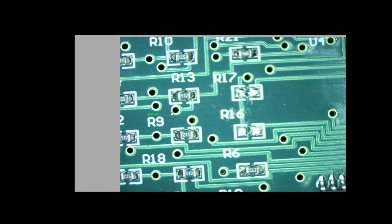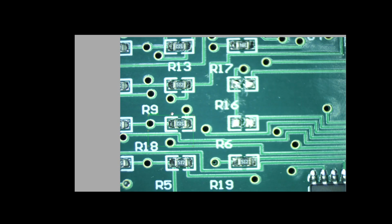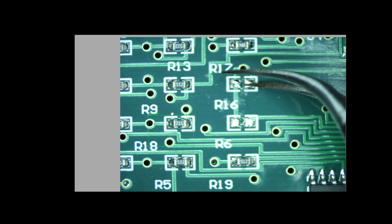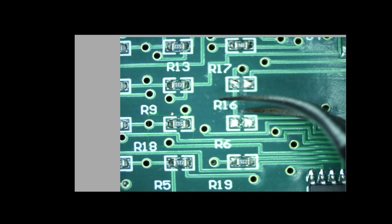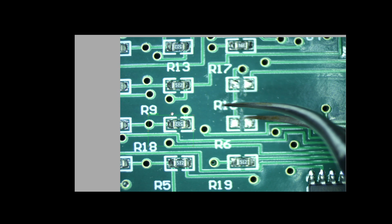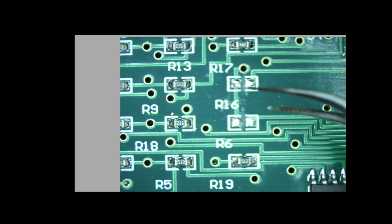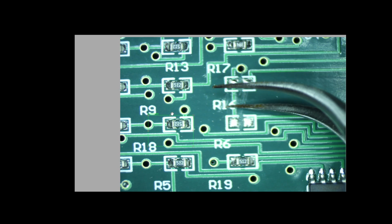Okay, I'm back now. One thing we need to do is clean up this area. I want to remove that solder and actually put some leaded solder. I know this is not the industry's way to do it now. They like to use lead-free stuff, but that stuff takes such a high temperature to melt, and it doesn't make that good of a connection, in my opinion.